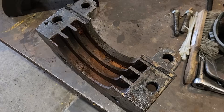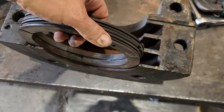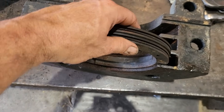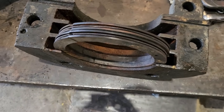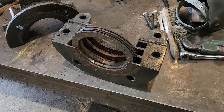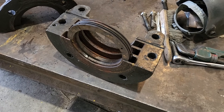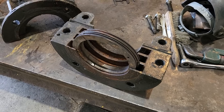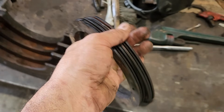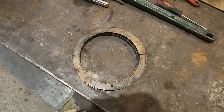Each set of packing fits down into its little slot. These are one inch wide — it's a one inch slot and it fits in there fairly snug — and then there's a top cap that goes on there, and that forms the mechanical packing for the high pressure side. All of this stuff is completely worn out and has to be replaced. Fortunately there is a company that still makes this stuff, and I have just sent them an inquiry on this size, which is a seven inch diameter.